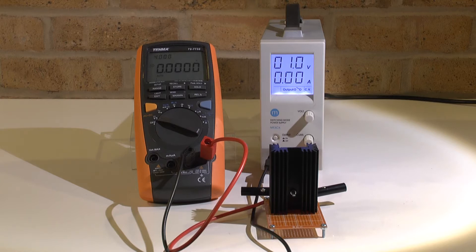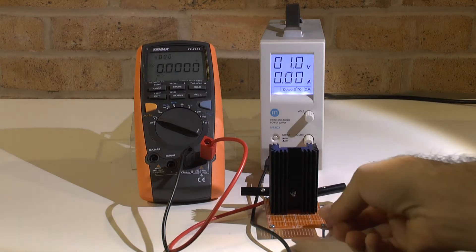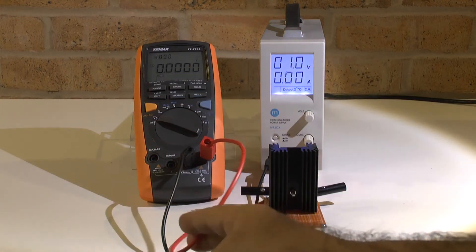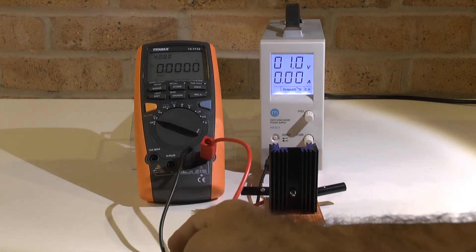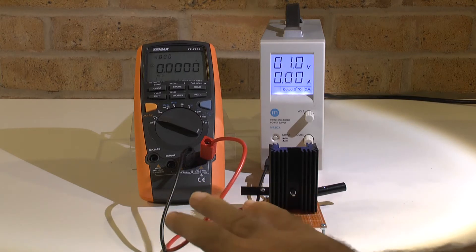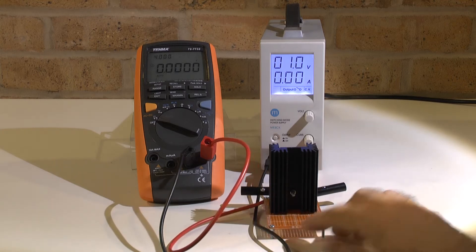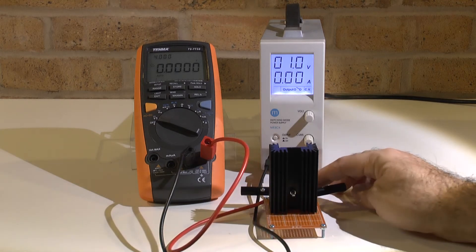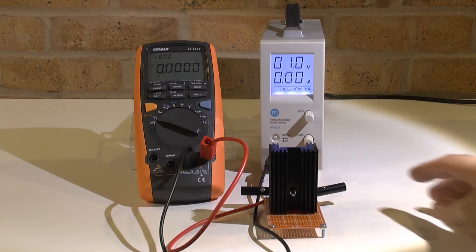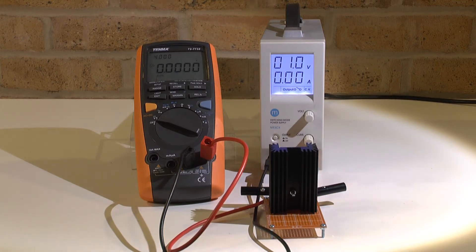What I have done here is connect a direct short lead from the resistor — that's why it is backwards — from the resistance over here to the input side, in parallel. Before I did that with standard wiring it showed about half an ohm, which completely threw off my measurement. Now it's a very short, direct connection with a 2.5mm copper wire only about 5cm long, so that is working.